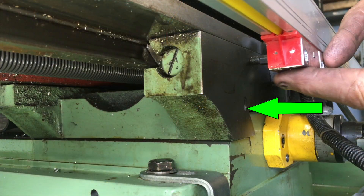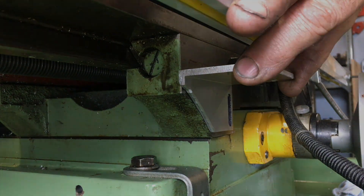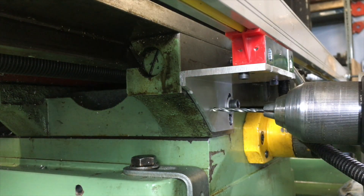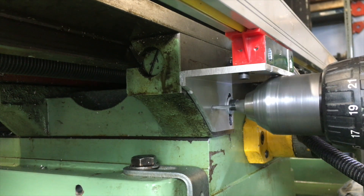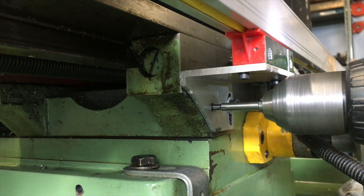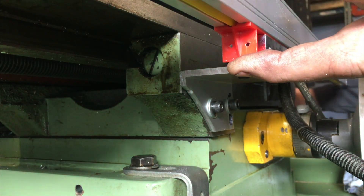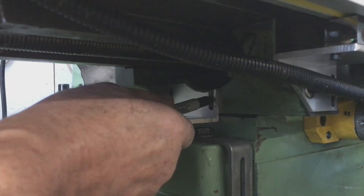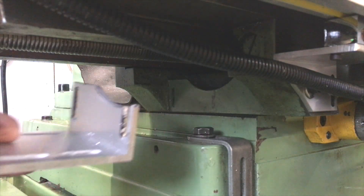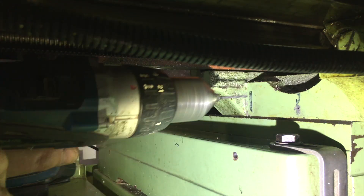The DTI was run up and down the top and the side of the scale body before the final clamping. Just here is a pre-drilled and tapped 6mm hole that I made off camera to suit this angle bracket that I also pre-shaped on the bandsaw. Before I finalised the angle bracket position I fitted the two sensor screws and nipped them up to hold the bracket in place while I drilled and tapped the final hole. So far this was the easiest one that I fitted. Now with the bracket firmly in place I removed the retaining strip. I had promised on the previous video that I might be able to show you how I set the studs, but as luck has it I still had very little room to get the camera in.